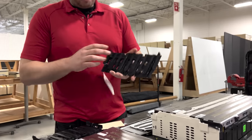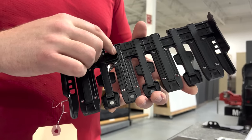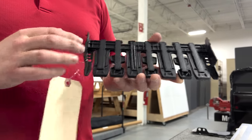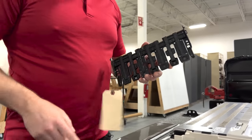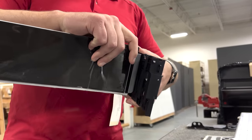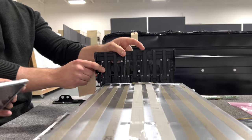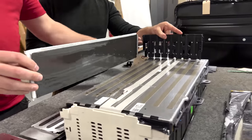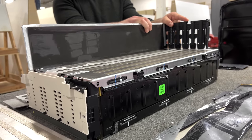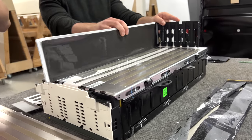Another interesting feature: the back of the current collectors has injection molded strips covering a non-uniform surface. The question was why cover it — why not just mold it as a flat piece? This surface is flat to allow the separators to sit. There's a gas separator in the event of an off-gassing event. Everything runs long-ways since these are Ultium cells and they're much longer. This is a 3P8S configuration, so the separator goes between each group of parallel cells to provide both thermal and electrical isolation.